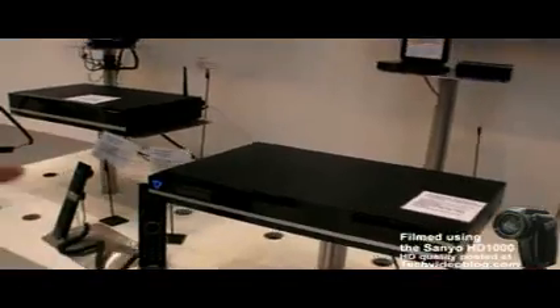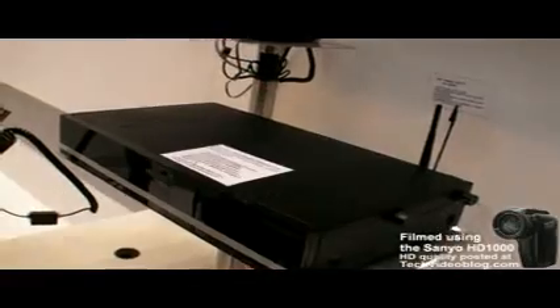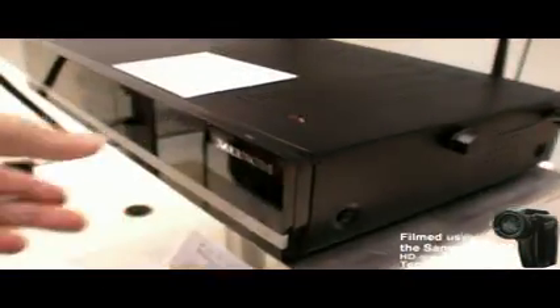These are different products — how do you differentiate? Basically, this larger one is the big version of the small box. It has all the internet connectivity things that the small box has, plus it has two digital terrestrial tuners and an integrated hard drive, so it can do PVR, time shifting, trick modes, all that. Plus it can also access internet-based and network-based services. You could download videos on it from the internet — it depends on the business model. Some operators do download-to-own, while others like MaxDome currently just do video-on-demand streaming.